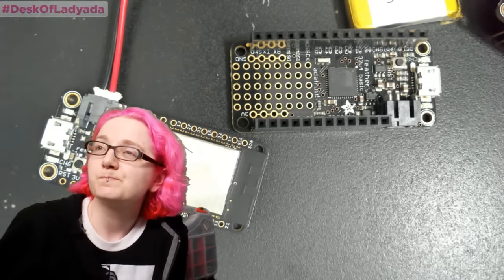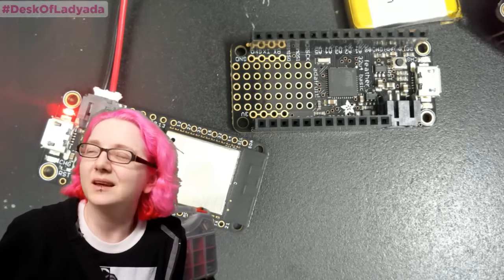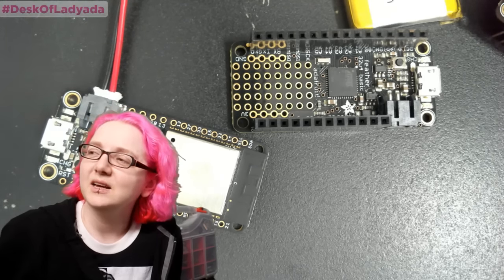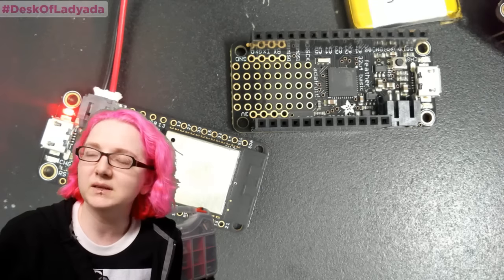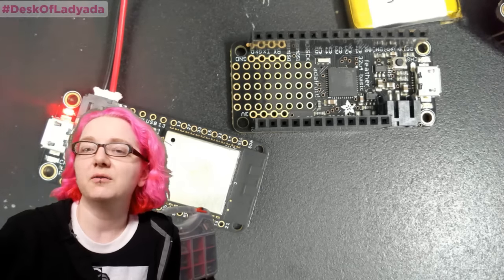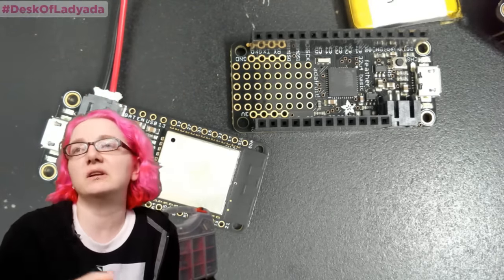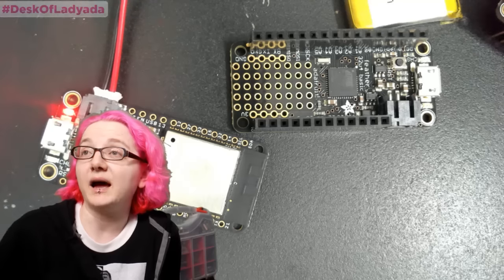Okay, is the datasheet published for the ESP32? Whatever documentation there is, it is published. Espressif doesn't have the same kind of data sheets you may be used to when using chips from, like, TI. Life always doesn't give you a data sheet. Yeah, a quote from Ladyada. You do get there. There's more documentation coming out, which is really nice. But it's not like the SAMD data sheet that I've been neck deep in, where pretty much every register is documented, every process and procedure, with full example code and middleware code for everything. The ESP32 is basically released as: here's a working code base and here's some information and stats. But anything that's on the Espressif page, we're going to be using. What we have right now is this version 0 silicon, because that's all we have. But when we get version 1, we'll swap it out.